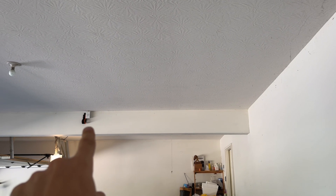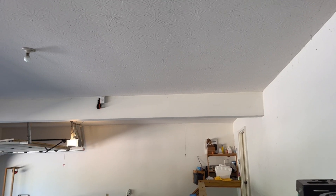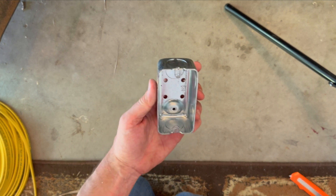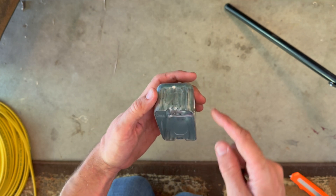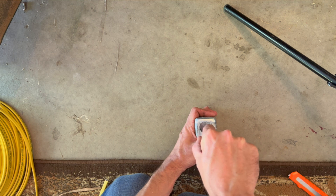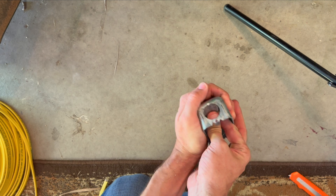Put the cover back on and then run your wire — up and over and down. I wanted mine in the ceiling so I put it over right there, and you pull it through. When you've located where you want your electrical outlet and you've got your box, mark it on the wall. Find out where the wire is coming in, whether from the top or the side. In my case it came from the top, so locate the knockout circle on the box, wiggle it back and forth a few times, and punch it out.